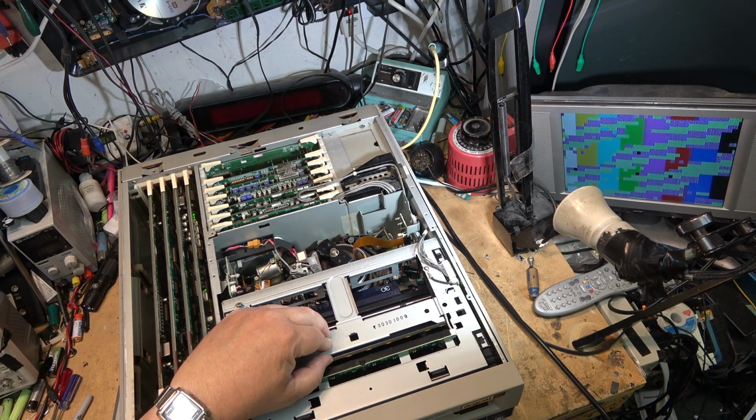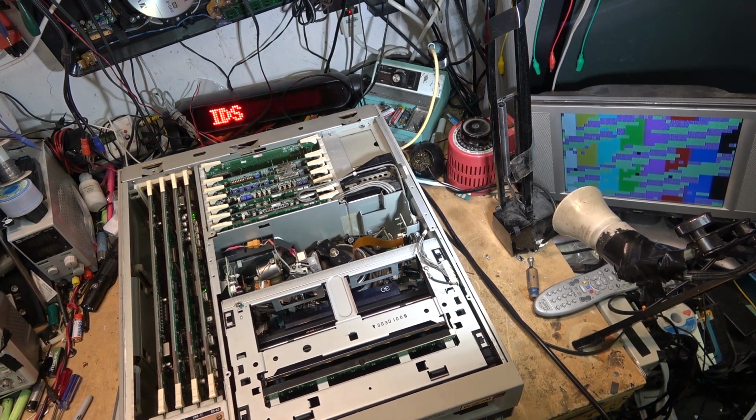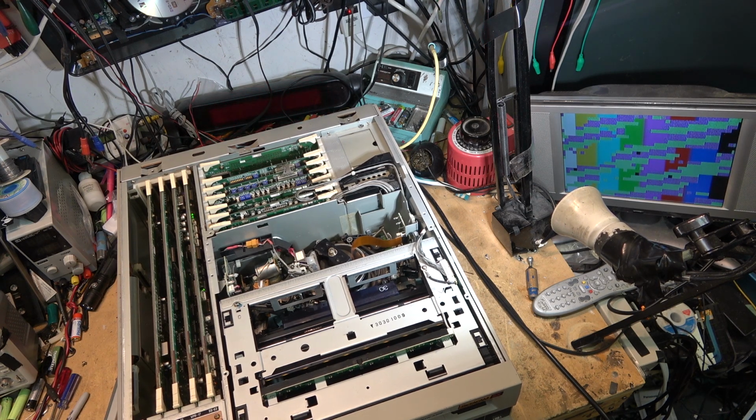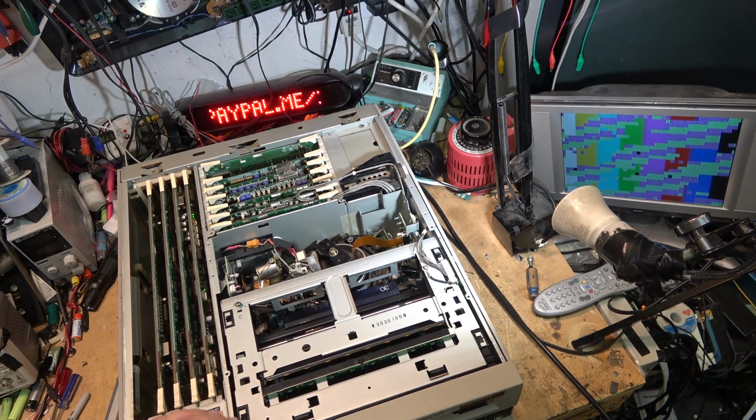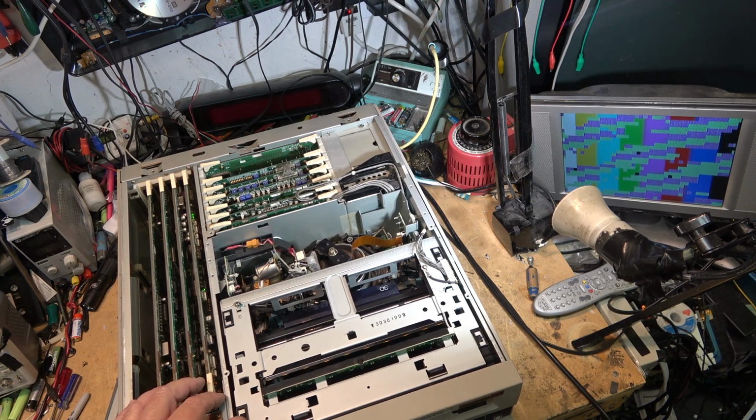Oh! Well, I played something. Those are the color bars off the tape. Well, isn't that interesting? At least I know it's getting some signal, and I can play with the chroma phase with the controls and the black level. I'll put it back to preset. Video level. So that part's working. I'm just not getting anything off the tape. But I did get color bars there for a minute. Interesting.